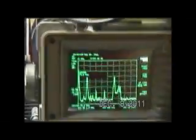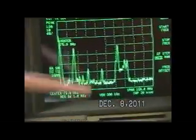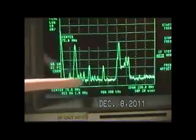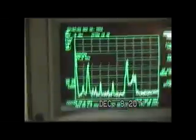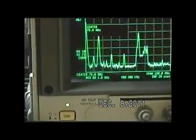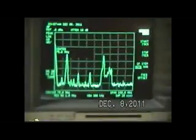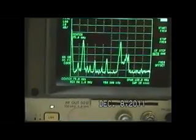If you want to see the spectrum, I can show you that. This right here is the 22.2 MHz, and you can see the sidebands down here. All of this is coming from the exciter — I can show you that by putting my finger right here on this block, which is the exciter side. You can see it kills those harmonics and reduces the level of the other ones. If I touch over here on the generator side, you see it has very minimal noticeable effect on the exciter side, except it does attenuate the signal coming from the generator. My pickup into the spectrum analyzer is via this antenna, which sits right above the exciter itself.